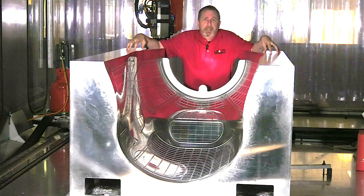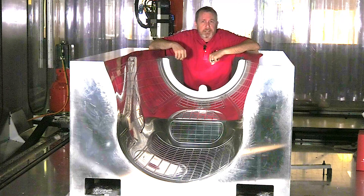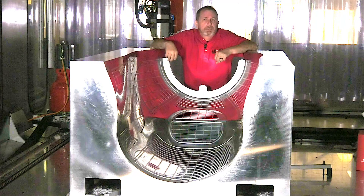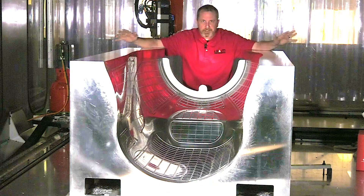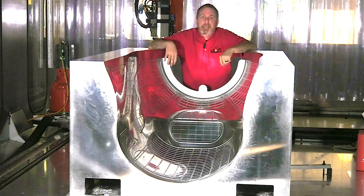If you really want metal, cut layer additive can do that too. This is an aerospace trim fixture, and yes, it was made using cut layer additive. It's made from large sheets of inch-thick precision ground cast aluminum jig plate. Although it looks solid, it's actually hollow. All of these surfaces are only a bit over an inch thick, which means it uses less material than about any other way of making it. High-speed CNC routing of aluminum is somewhat slower than routing many other materials, but it's many, many times faster than conventional machining — which means the entire process, cutting and assembly, takes less time and labor than about any other way of making large aluminum molds and tools.